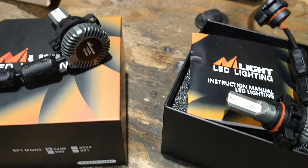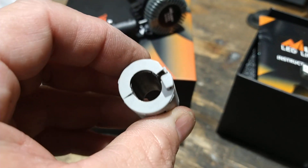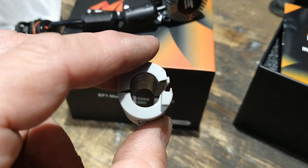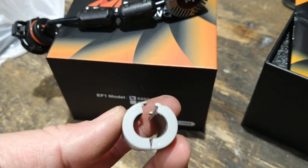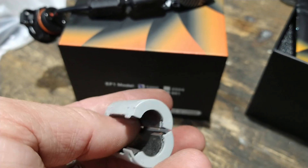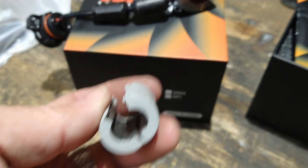Alright folks, thanks for watching. Hope this can fix any problems for you guys having radio interference — not only in a vehicle, but also in your house. If you've got a noisy switching power supply, put this on the DC coming out going to your CB radio, amplifier, whatever it is — wrap them up with these things. They come in all different sizes; you can get them on eBay, Amazon, wherever. They do have different ferrite mixes with different properties for different types of interference — you'll have to look that up. Alright folks, take care.